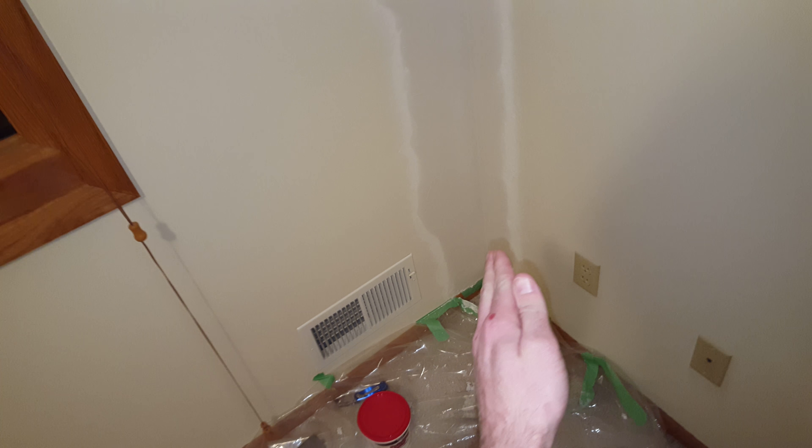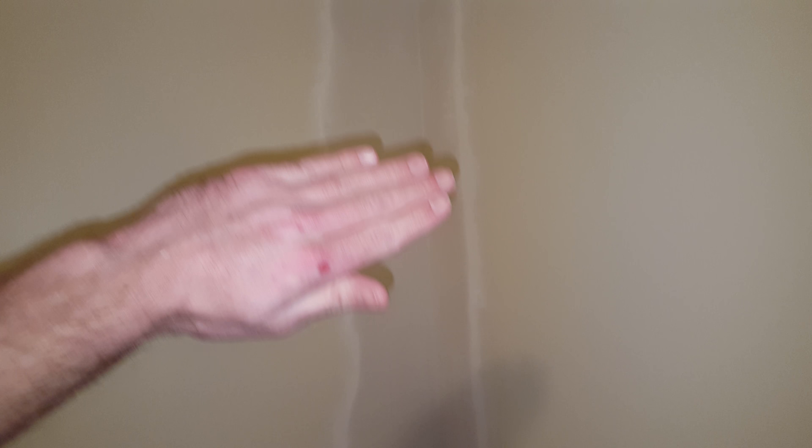About a half inch of it was actually bent in right here, so I puttied that in before I put my wall tape up. And then up here it was starting to separate — it wasn't too bad, but I decided to dig it out more and pack some more mud behind there, and then also raise it up gradually to give it a little more bite. Of course it's going to involve lots of sanding, but that shouldn't be too bad.